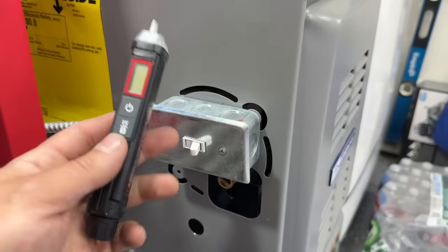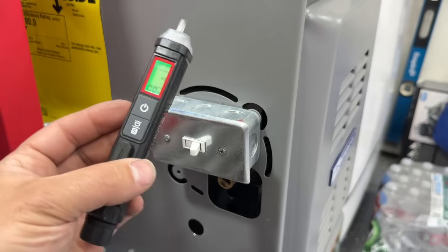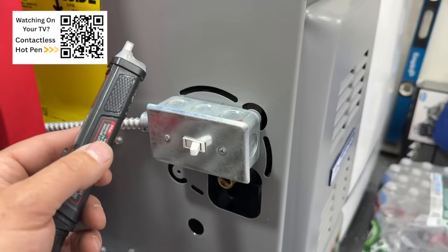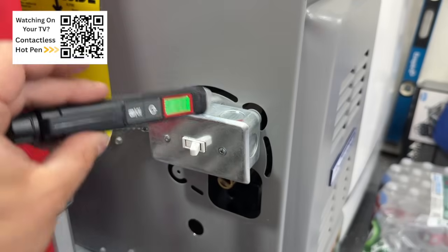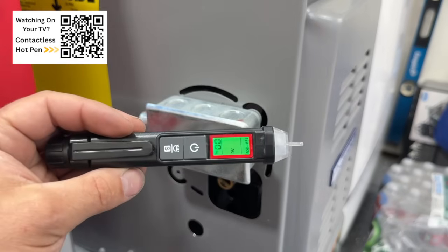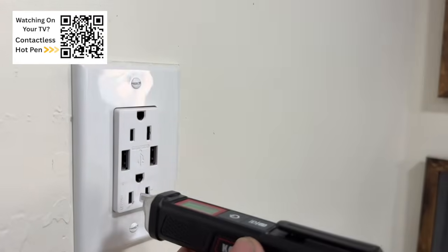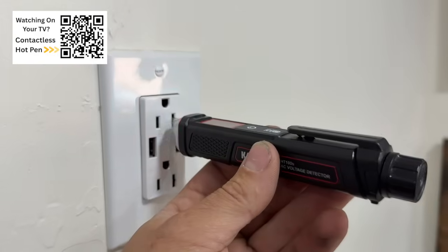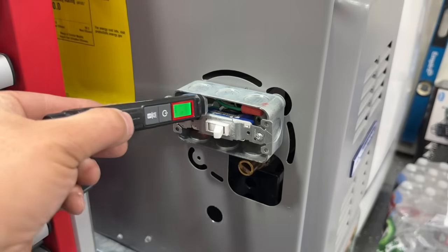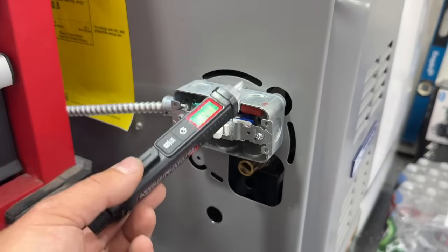If you don't know which breaker is for your gas furnace, I want to show you how critical this tool can be. This is a non-contact voltage tester — you can find it on Amazon for super cheap, link in the description. I'll demonstrate on another active outlet in the garage: as you can see, it's alerting us, letting us know that there is AC voltage. And now up close, we can verify there is no power here — no beeping, no red flashing. That means there is no power.